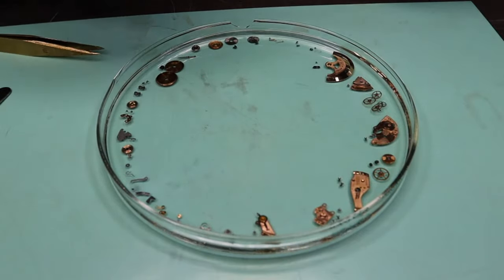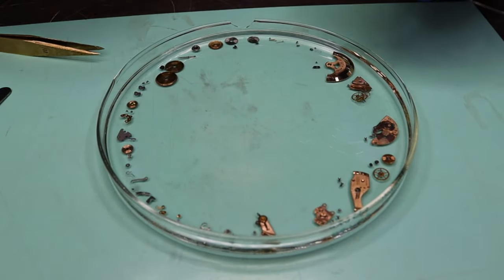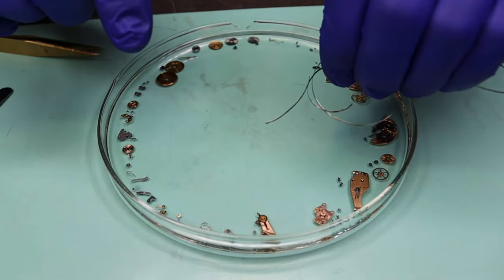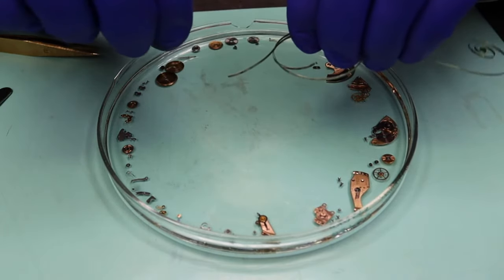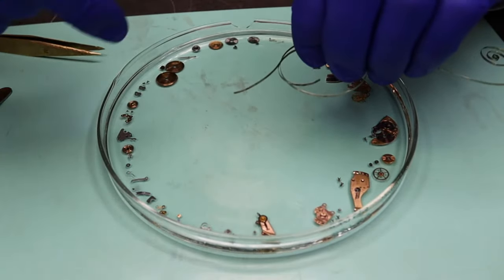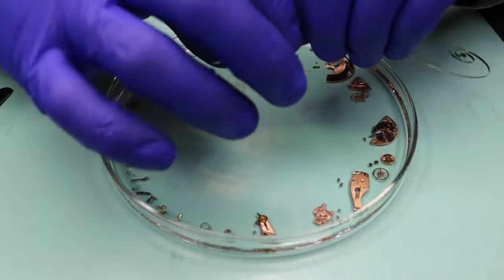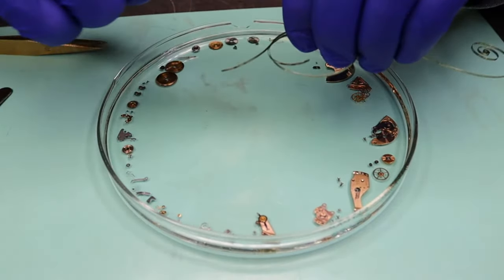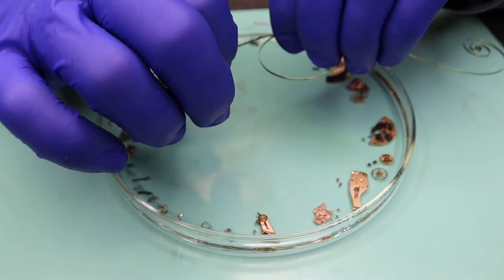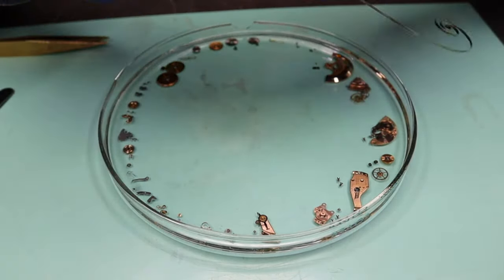Here's the barrel. And what's great, the automatic never actually winds up full, or essentially it does, but it never is held at full. So it has this bridle on the end of the mainspring. Can you guys see that? Yeah. The bridle on the end of the mainspring is the slipping mechanism: once it gets too tight or too wound up, the mainspring just slips in the barrel. Because if it was held, you could wind your watch until the point where it breaks the mainspring. So they put this bridle on here so that the mainspring can slip, but you don't want the mainspring to slip too soon, so this bridle's just a little bit extra tension to hold the mainspring to the outer edge of the barrel so you can hold a charge, essentially.